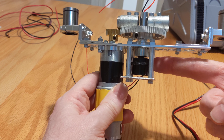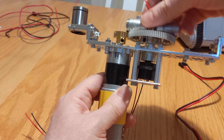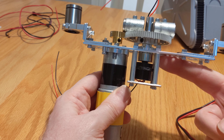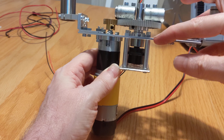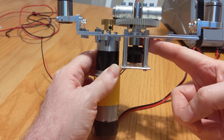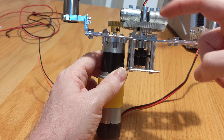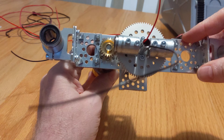The slip ring allows power leads to go up into it, and then at the top it rotates and allows wires to rotate without twisting up. The slip ring is mounted right in there. Then there's a locking collar, and instead of a shaft I've got a tube coming up through — you can barely see it, but right there is a pillow block bearing, so the tube goes through there and the collar keeps it from moving. There's a mounting hub here with screws to mount your gear on, and a set screw that locks onto the shaft — in this case the tube — where my wires come up.